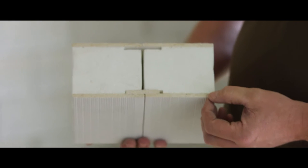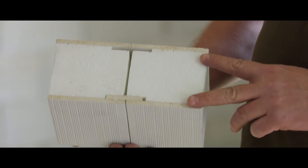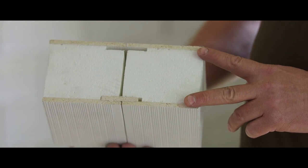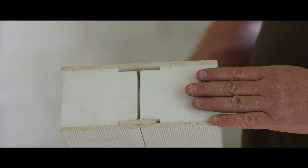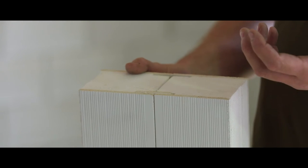The basic components of the Wahoo wall system are a magnesium oxide outer skin laminated to both sides of a three-and-a-half-inch thick piece of expanded polystyrene foam core. This is a closed-cell product — it is basically waterproof. Any water that absorbs, which would be somewhere less than one or two percent, it will also allow to release. For this reason, the system will not retain water and hold on to it.